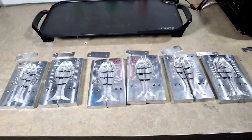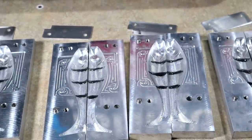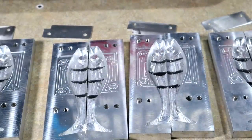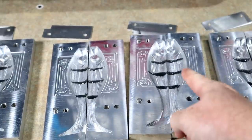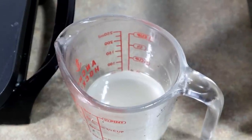Wide angle view — we have them all striped. Now we need to add the next layer, which is going to be a skin layer. That will not only lock in our black stripes in place — you pour a hot layer of plastic over those and you don't need to worry about your stripes falling out of place in the mold during the pouring process. It kind of locks them in, and it will provide the green middle color. The bright chartreuse is the middle color; the green color is technically on top.